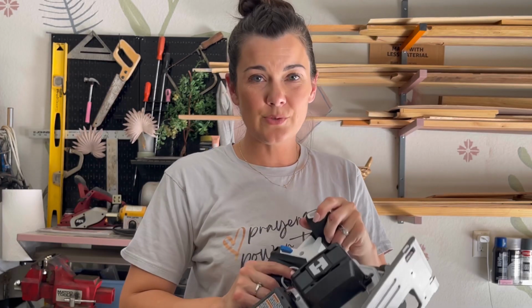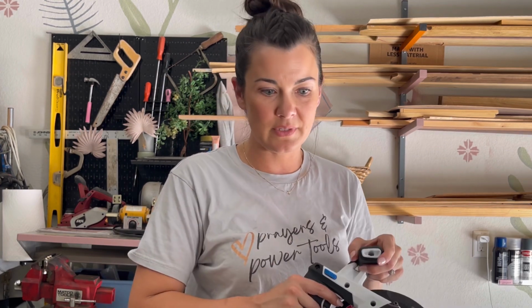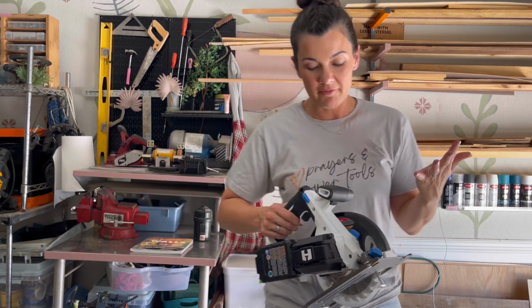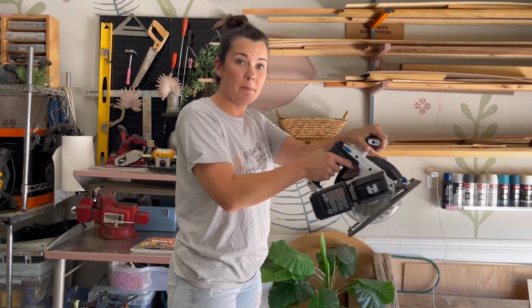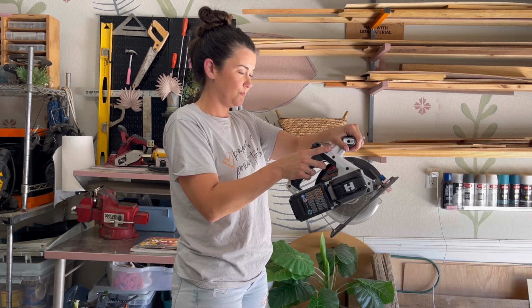So I always recommend my students listen to their saw several times, starting it without using it. It helps you gain perspective on how powerful the tool is, what it sounds like. It helps build your confidence because you're going to be getting used to that sound, because the sound alone is one thing that can be really scary, I know. So hold it away from your body, make sure you have a good grip on it, and listen to it a few times.